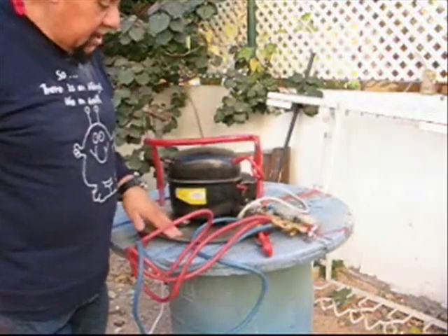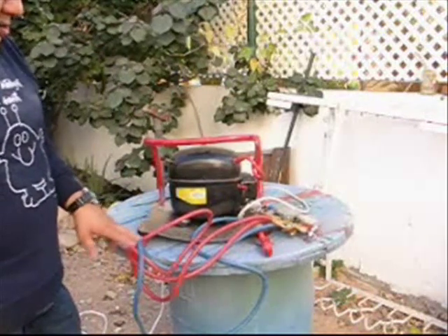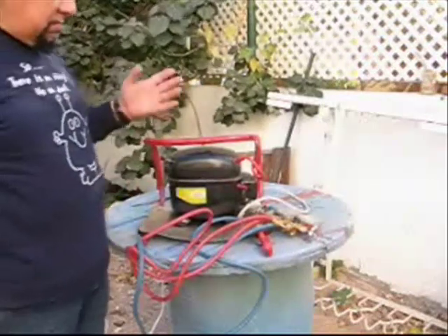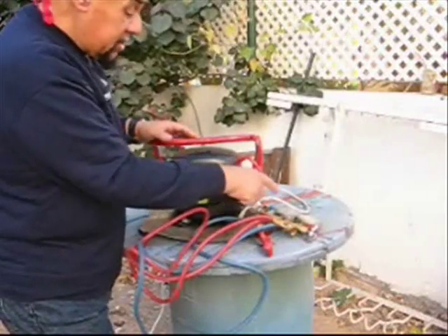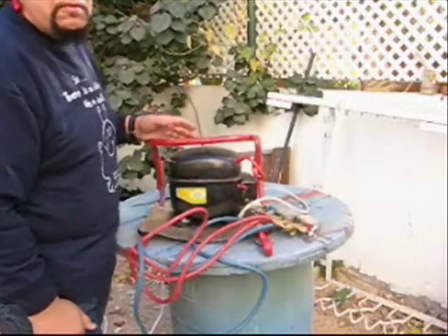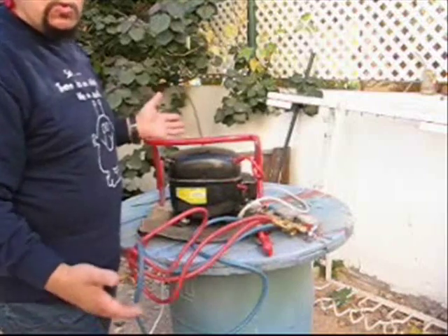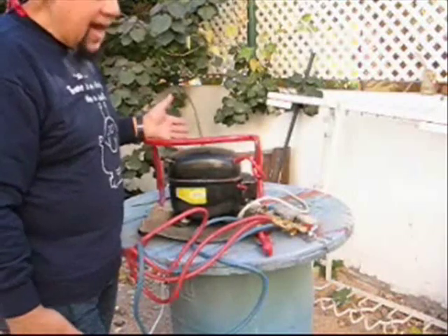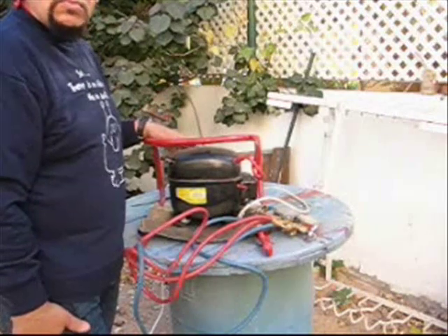A simple stainless steel base mounted on four pins on the frame so as not to puncture the frame. If you wanted to make it into an air compressor, instead of taking from the suction, you mount it on the discharge into the frame. You would then need a small pressure control set for about 120 PSI to regulate the air pressure. This can be used for small jobs around the house — especially good for cleaning a computer, with a filtered air supply and a small pistol to clean dust, which is a real killer on computers.